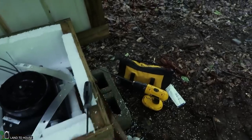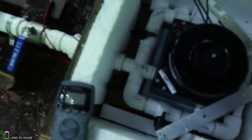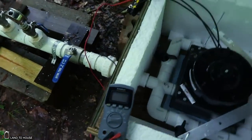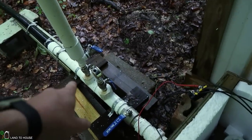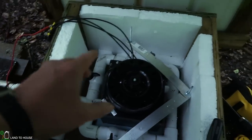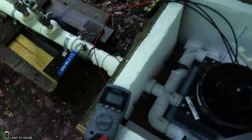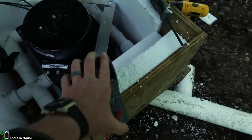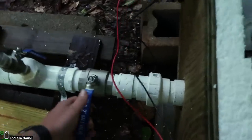I used a long drill bit to put a couple of holes down in the bottom to drain any water that does get into the housing. I also got the multimeter. We had 196 volts before with one jet before I locked everything down, so I'm curious — let's turn this on again and see what we get with the housing locked into place. I wonder if it will produce more voltage.